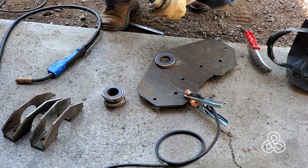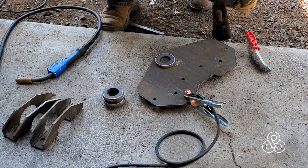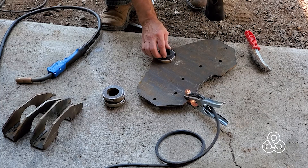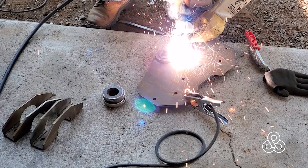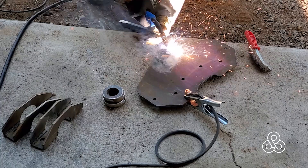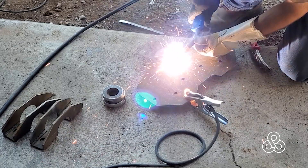This is all going to bear on a big stainless steel pin, so I'm adding these half-inch rings that are going to spread the load out rather than the bearing weight being just a quarter inch on the steel pins. There's also a bushing that's going to slide in there — I'm going to put that bushing in to line this ring up while I tack weld it. Then I'll pull the bushing out because it is plastic, and go ahead and weld these rings on and get them bonded on there nice and tight with a good bead weld around it.